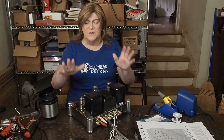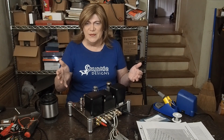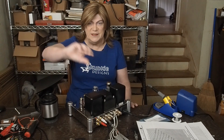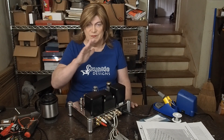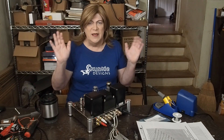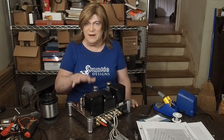From what I've heard out of this, you could put some 6V6s in it without touching the amp, hook it up with a powered sub to fill in everything below 200 hertz, set the sub crossover as high as you can get, and it'll probably give you reasonable performance. I hooked mine up with my little powered sub and it sounded pretty decent — definitely a huge improvement over the way this thing comes out of the box.